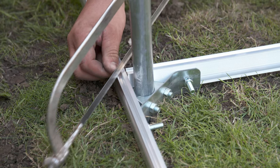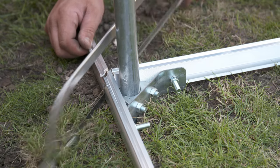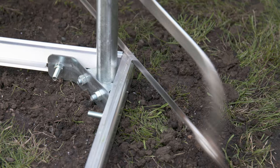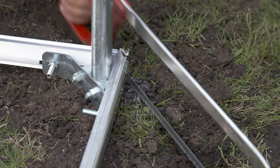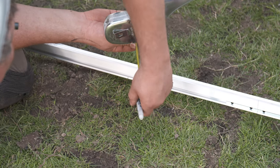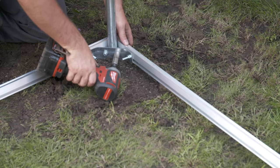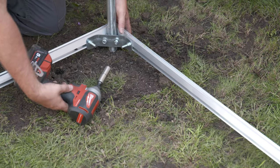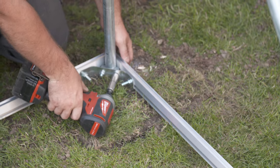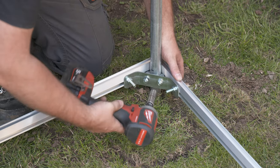Cut the aluminium on the corners of the polytunnel at an angle, making sure to smooth off any sharp corners. On any sides where a base rail is being used without a side rail, mark the hoop 2 inches higher and lift the rail to this point. Once covered, the rails will be pushed back down to ground level to pull the cover drum tight.